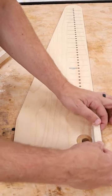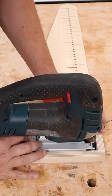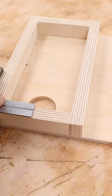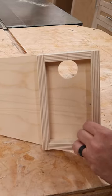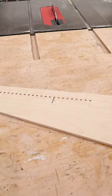I just glued these little strips to the trammel, making sure that everything was nice and square, and that the jigsaw fits snugly inside. One final detail is that I marked reference lines to show where the inside edge of the jigsaw blade lines up with the trammel. You can see here that this trammel has a center hole, and also pivot points that line up with that hole.